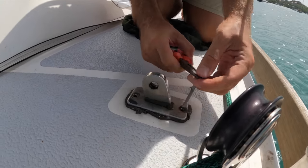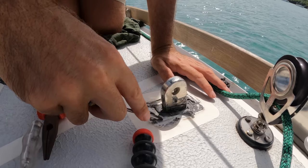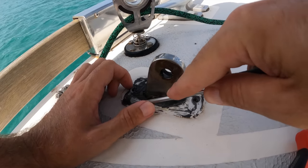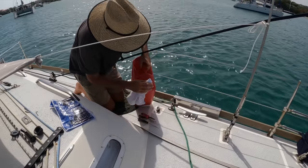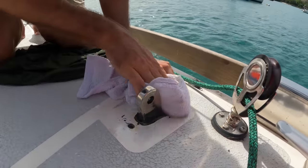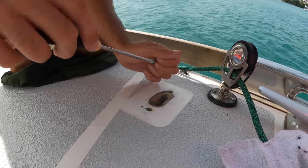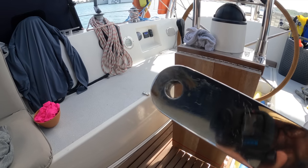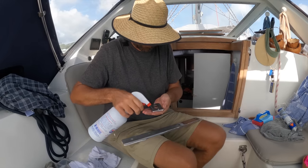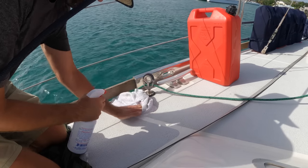With the chain plate covers removed I could start getting rid of the old butyl tape. One of the big upsides to butyl tape is that it's very easy to clean up and re-bed. I scraped off the majority of the butyl tape using a flat-headed screwdriver and then used a little bit of diesel to dissolve the rest. Butyl almost instantly dissolves when it comes into contact with diesel — great for cleaning up, but it also means you shouldn't use it anywhere that might be exposed to diesel. To make absolutely sure I did a good job, I decided to remove the chain plate to be able to clean every little speck of butyl. There was a little bit of cosmetic rust on the chain plate, nothing to be concerned about, and autosol did a great job making the chain plate nice and shiny again. I made absolutely sure to remove any trace of autosol or diesel from both the metal and the deck before attempting to re-bed the chain plate.